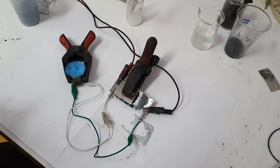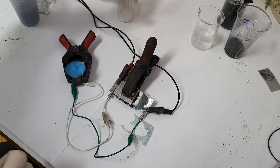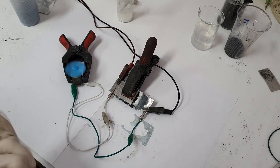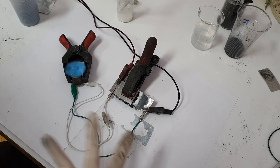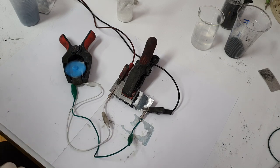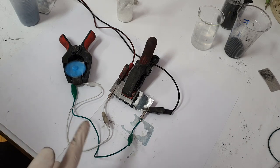Basically the design of this battery is: I use aluminum as the current collector, I put the electrolyte — potassium hydroxide together with zinc oxide — on it, using half a spoon of zinc oxide into 30 milliliters of 3 molar potassium hydroxide. Then I put a separator which is tissue paper, soaked in the same electrolyte. The positive active material is activated carbon.